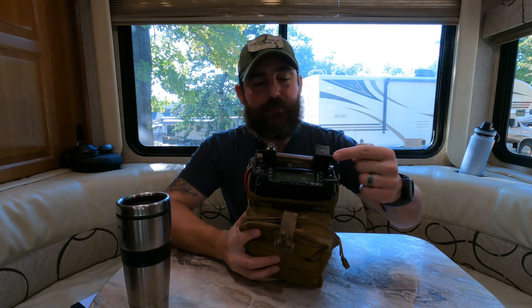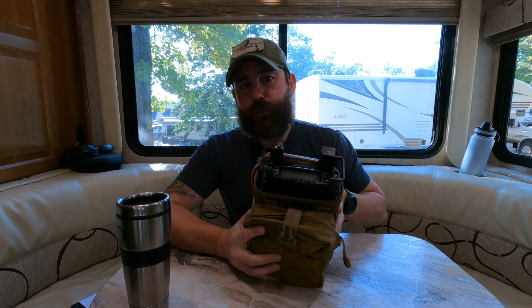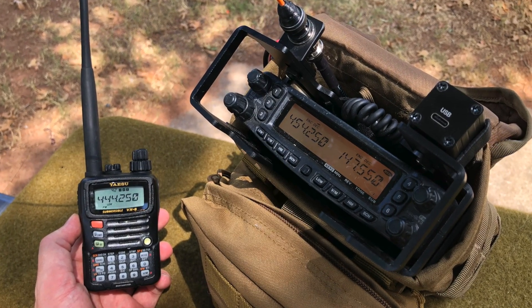The main reason I decided to step up to this rig from the 6000 is that there are actually two sets of knobs on either side. And this rig is a true dual VFO rig. So for the new guys, what does that mean? Well, basically it has two radios built in — an A-side and a B-side. And this is not like your Baofeng radios that do dual monitoring. With dual monitoring dual-band rigs, it's kind of switching back and forth on receive, and it looks like it's doing dual VFO. VFOs basically are a ham radio propeller-head way of referring to the dial — the variable frequency oscillator.